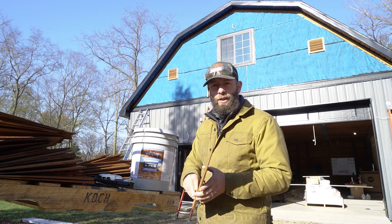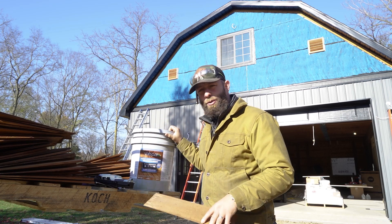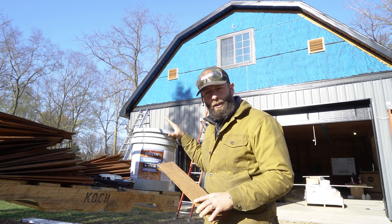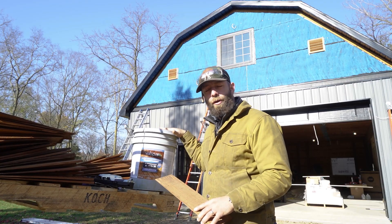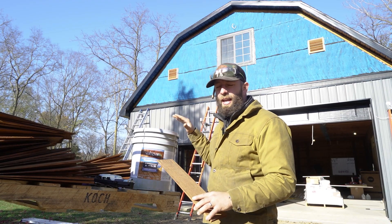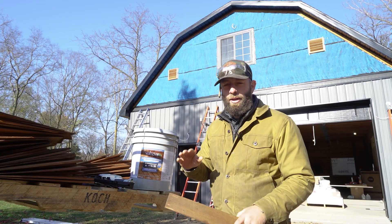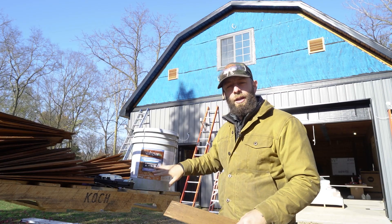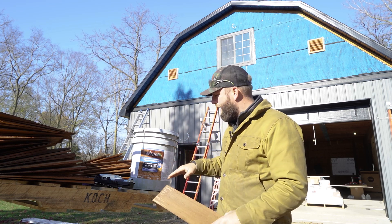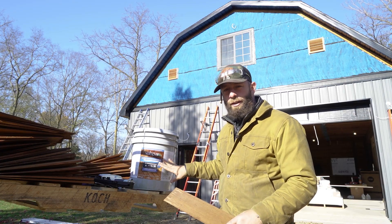You can also buy these cedar shingles with whatever color paint or stain already on them. What I did was stain mine using this Valspar transparent one-coat exterior stain and sealant. Valspar is sponsoring this video — I've used this same stuff before on my deck and had really good results, so I'm confident using it again. That was on a horizontal surface and it held up really well as a semi-transparent finish. The more solids, the less transparent the finish — the less transparent, the more durable it is. Semi-transparents are a little more durable, and full solid stains last the longest.